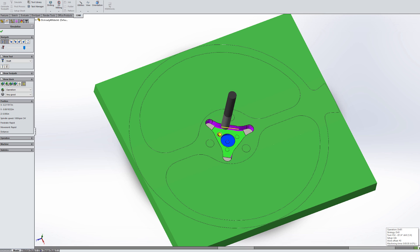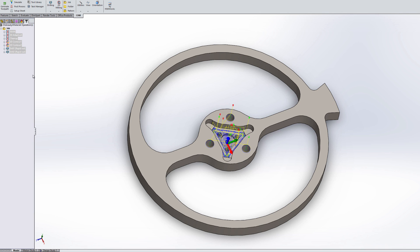After that, it's just a matter of piloting these six holes — three on the bottom and three on the outside. Once we spot drill these, we'll take it over to the drill press and cut them all the way through. That's really all there is to it.